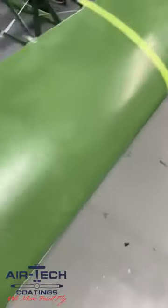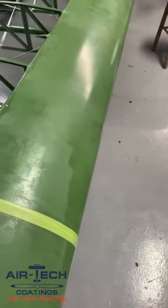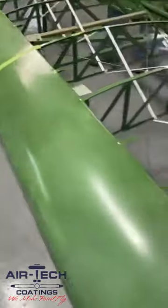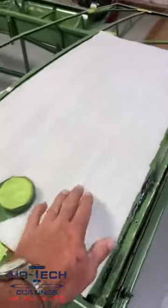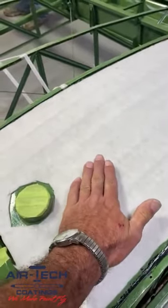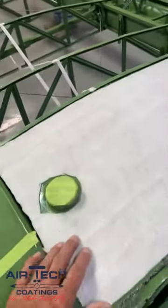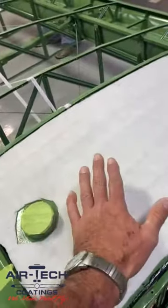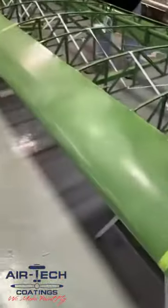These videos are going to be a combination of little short strips or just pictures, and I'll narrate over what we do. So as of now, you've got everything like I did in the other videos ready to cover. What we did on the tanks, these tanks go all the way to the surface, and I don't like the fabric right up on the surface and moving. So we laid down pad, and I'll talk about what we do on that. We used AirTech glue thick, cut the pad, glued it to the tank, and we'll talk later on what we do on there.